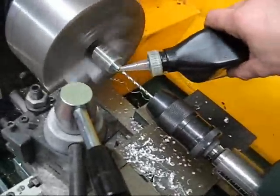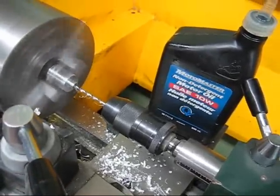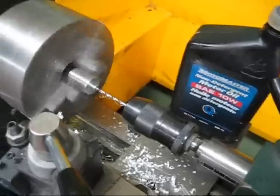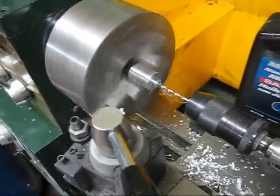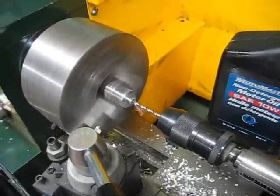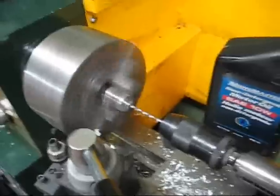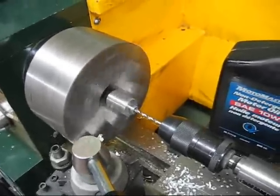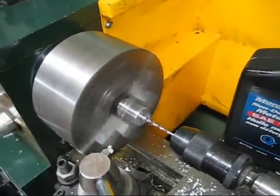Use a bit of oil! Come on! There we go, use a bit of oil. See what that sounds like? Yeah, cutting like butter. In and out slowly, guys. I'm gonna drill right up to the holes. Out again. Back out again. I gotta love cobalt and steel, man. Look at that. Don't need carbide. Carbide will snap. Cobalt drills.